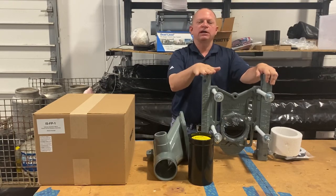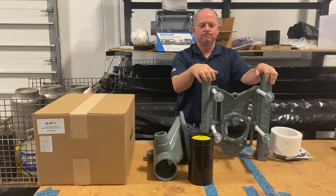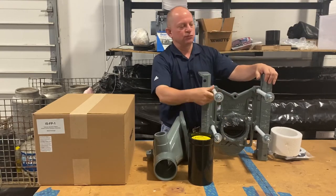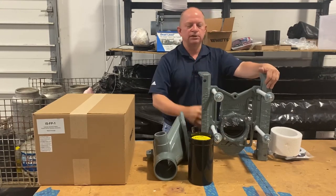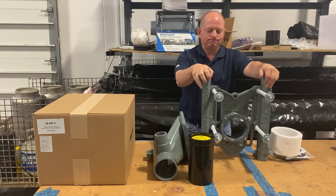...is that as you see this faceplate, this is how it is in the box — they assemble the rods on here for you. Now if you're doing 50 of these, just think of the savings that gives you where you don't have guys screwing in rods, nuts, and bolts. They've already done it for you. You simply pull it out, bolt it to the plate, get your height right, and on you go. That's another nice part of the closet carriers.